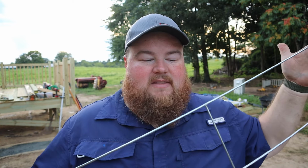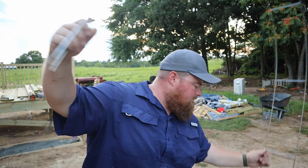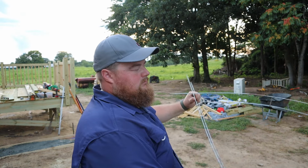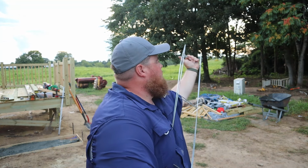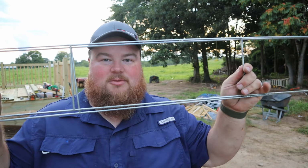What I'm gonna do is just bend this over in half, and I've got two of these. So bend them over, slap them down halfway through the thickness of this slab, and that's gonna be plenty of reinforcement for this thing. Where you lose an eyeball. There we go. One piece of ladder mesh bent in half, throw it in the slab and do the same thing with the other.